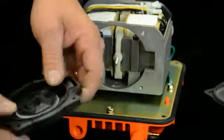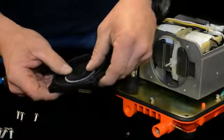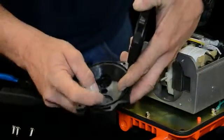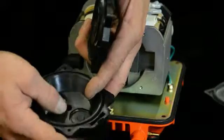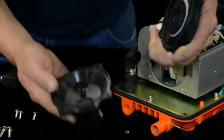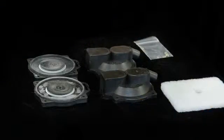Obviously this is a new one so it's in good condition — these are extra heavy duty. But you'll want to replace both of them every time, and your diaphragm block too, because in there's a little rubber check valve and sometimes they'll get hot and worn and torn up over time, so you want to replace both pieces at the same time. In the kit it comes with diaphragm blocks, diaphragms, new nuts and washers, and a filter — everything you need to do a basic rebuild.